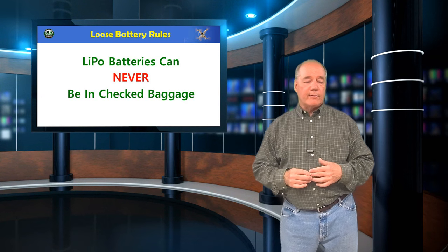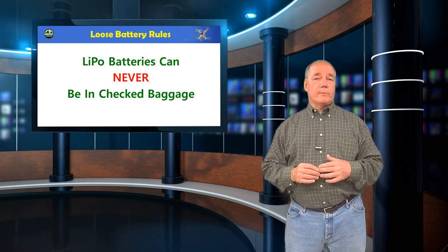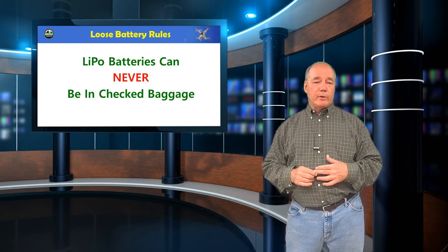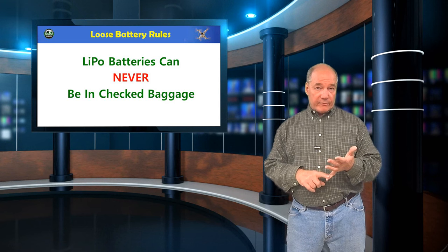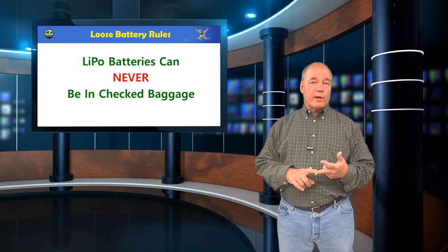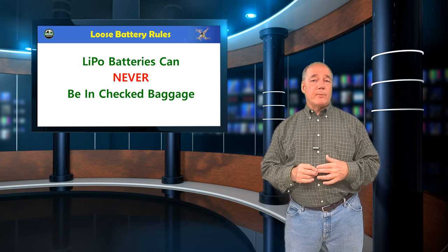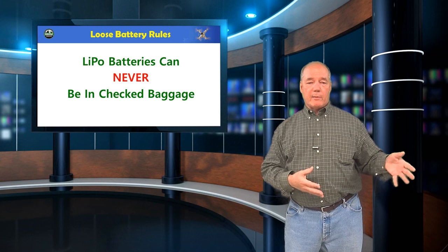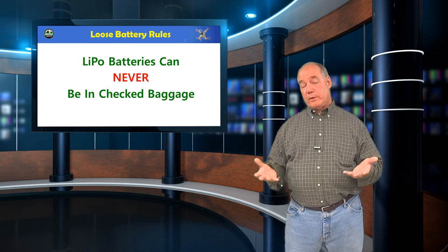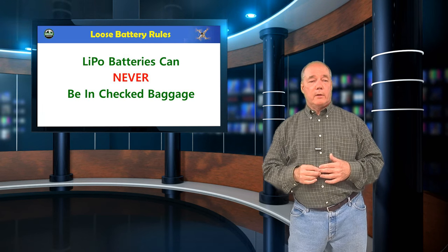The reasons for that are, I've talked before about LiPo batteries and how dangerous they are under certain circumstances, that they have the ability to overheat and actually burst into flames if abused. The way that typically happens is from physical damage, or if you get them wet, or an agitation of a pressure change, like on an airplane. Changing altitudes can change the cabin pressure. So if those batteries are in the bottom hold that isn't pressure controlled, they could go through a lot of different pressure changes between the altitudes, taking off, landing, changing different altitudes and approach, or leaving the airport.